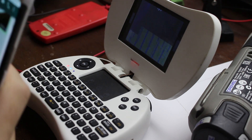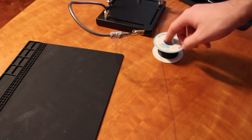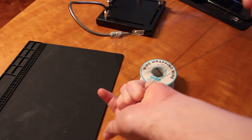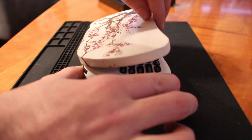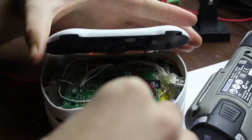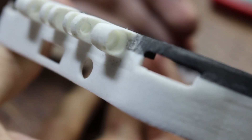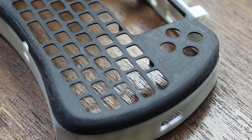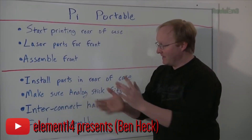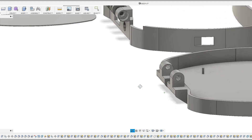Before I end the video, I want to look at some of the mistakes I made, in hopes that if you build something similar, you can avoid them. The first and biggest mistake was the choice of cable I used to connect the screen and the Pi — I used very thin single core wire, which was great for space but very easy to break. It hasn't broken yet, but every time I open and close it I feel it getting closer. That leads to my second mistake: why did I glue everything together? Yes, gluing gave it a nice seamless look, but as soon as a cable breaks I'm going to need to open it up for repairs and won't be able to do that. I do watch Ben Heck and must have heard him say 'always make things you can take apart' about a hundred times, but I still didn't listen. So I'd definitely recommend including screw holes in your design.